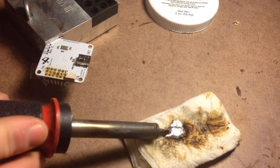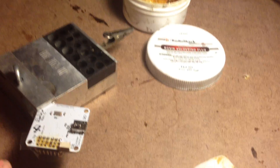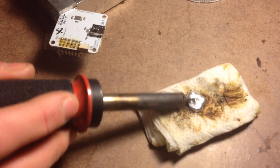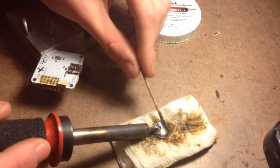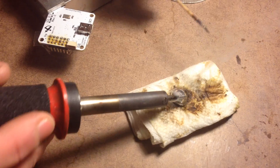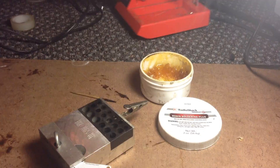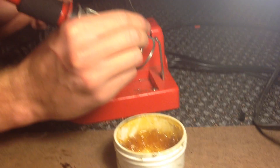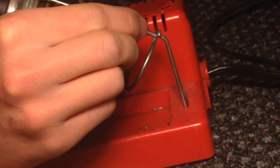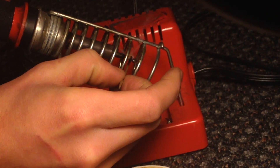So now that we've finished all this soldering, I'm going to turn our soldering iron off. You're going to want to just roll this around — you'll get some solder on there. Then you'll notice I'm going to take some flux and apply it; it'll instantly turn all that solder perfect silver again. That gets all that corrosion, stops all that, and makes your tip stay nice and silver too. So then we're going to put our soldering iron away. Whatever's left of our solder, just put a little bit on the tip and that's going to preserve the tip from getting corroded. And then just take a little bit of flux with the toothpick and put a drop on there just to protect the solder that's on there. And then we're going to let that cool.